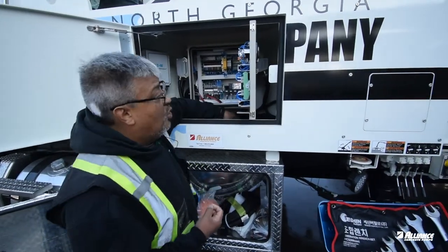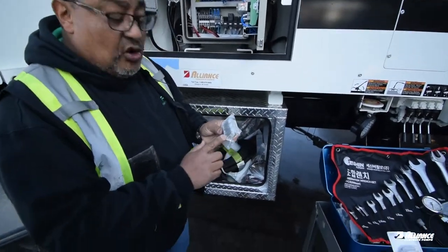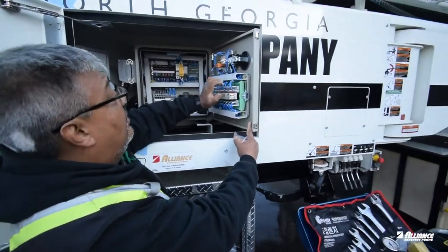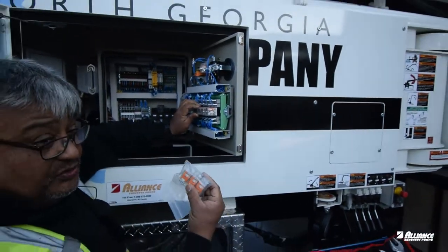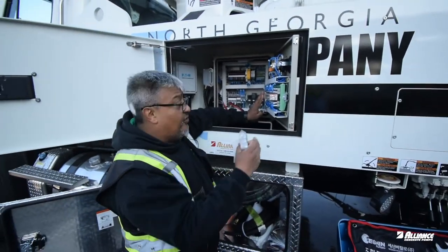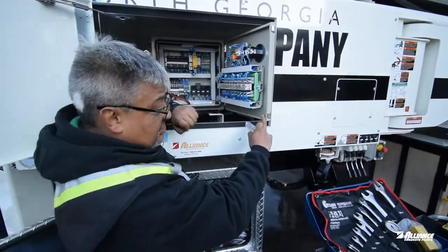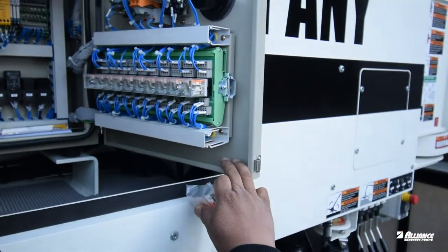With the new pumps, for safety and emergencies, we include three of what we call ice cube relays. Every single one of those relays in the panel for your other signals are exactly the same — ice cube relays. If one of those fails, you can swap it for any one of the spares. The number and the description will be stamped on the piece of fiberglass on top, so you can pull it out, change the relay, put the new one in, and you are ready to go and work again.